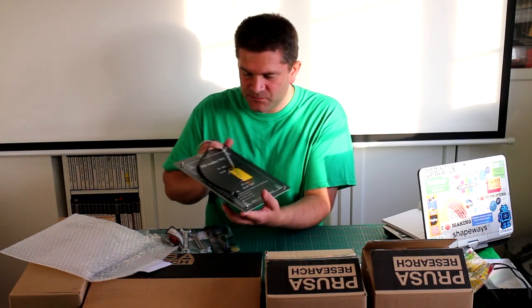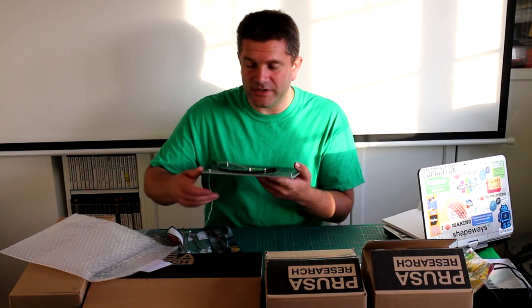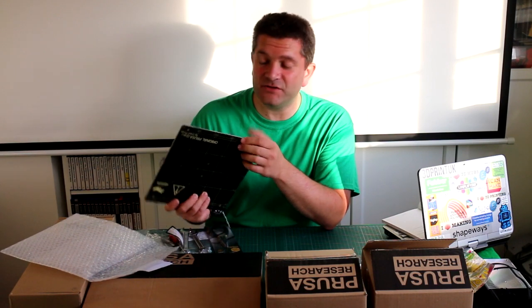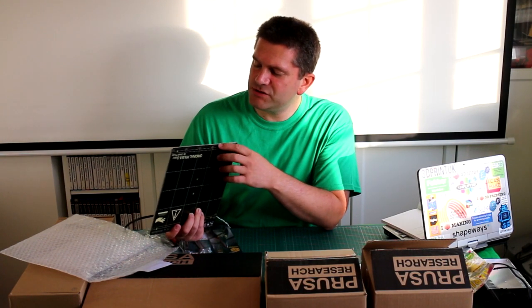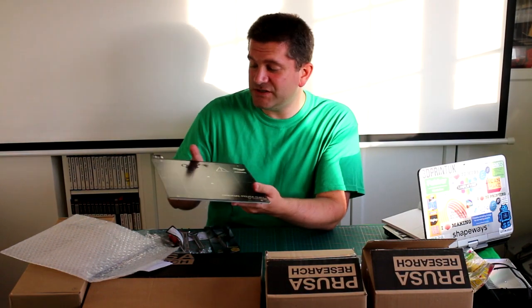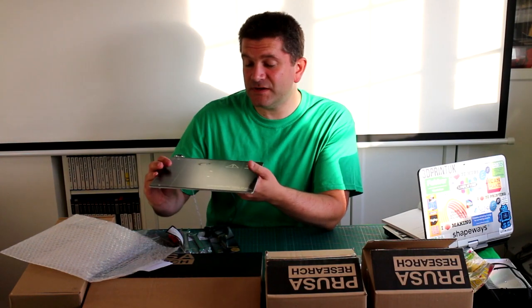What's really interesting is it's got some studs built onto it, and the thing that caught my eye was that it's actually a PCB laminate material. I contacted Joseph to ask him about this bed because I've been working in electronics for 25 years and I've used thick PCB materials before, but never quite this thick. The normal thickness of PCB is about 1.2 to 1.6 millimeters, and this I'm pretty sure is a 3.2 millimeter PCB. They've gone to the trouble of using a high-temperature FR4 PCB material, and Joseph told me that when they manufacture these they clamp them in a press to make them flat. This gives us a really solid, rigid build platform that's also lighter than an aluminium platform, so it can move a bit faster.